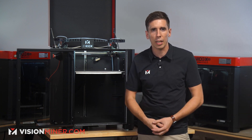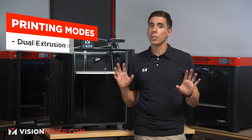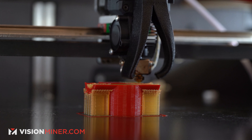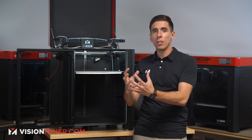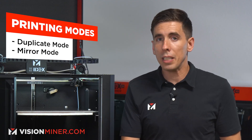When printing with the IDEX system, what modes do you have? Obviously there's standard single extrusion mode — one nozzle, any material, just like any normal high temp printer. You've also got dual extrusion, using both nozzles — one nozzle for the material, one for support materials like Aquatech, or multiple colors, or multiple materials like TPU and ASA for a living hinge, or nylon and carbon fiber nylon for a rigid strong core with a slick nylon outer shell. You can even use different nozzle sizes — a 0.8mm for the body and a 0.2mm for fine details on the same part. To make all that easier, we've got our automatic XY tool head alignment system.